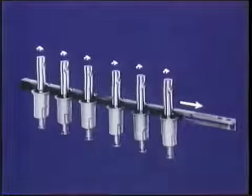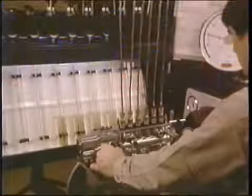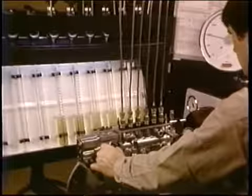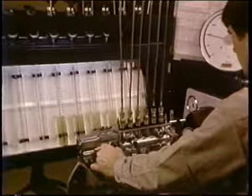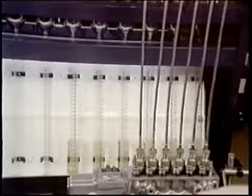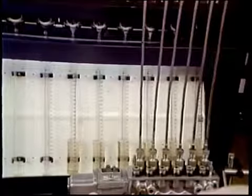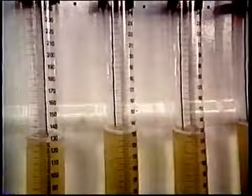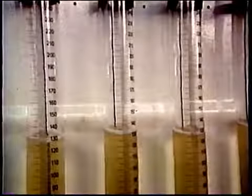When you think of the rack turning the control sleeve and plungers, you think of metering. As you know, pump rack position is determined by the governor. That, in turn, is changed by the operator's movement of the control lever and by the RPM. When you take a draw on the pump, you're measuring the quantity of fuel delivered for a certain rack position. The closer the spread, that is, the differences in draw among the cylinders, the smoother power the engine will deliver.